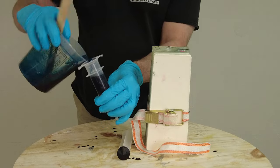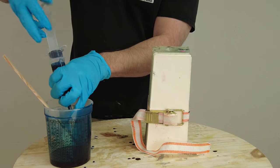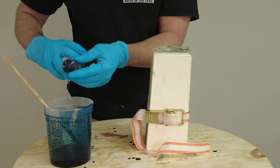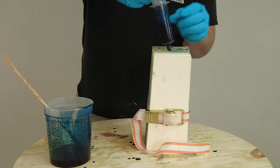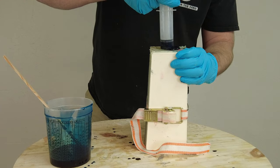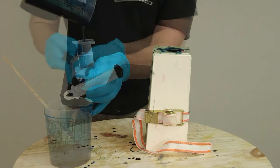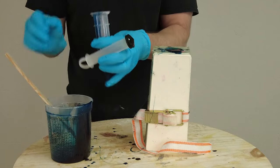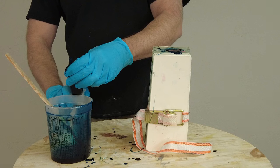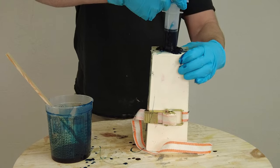I'm using my pinky to plug the syringe, then inserting the plunger to force the shot into the mold. This doesn't take much material, but using the syringe to force it in is critical. I was a little nervous about the technique so I went ahead and filled the syringe a second time — probably overkill — but this time I properly burped the air bubble out and then forced the rest of the material into the silicone mold.